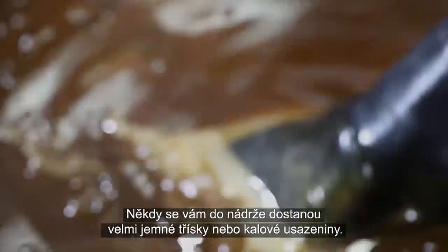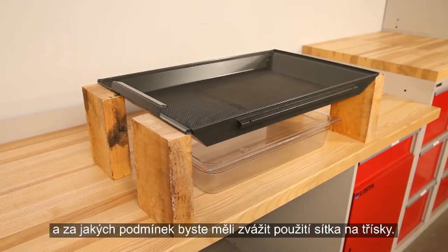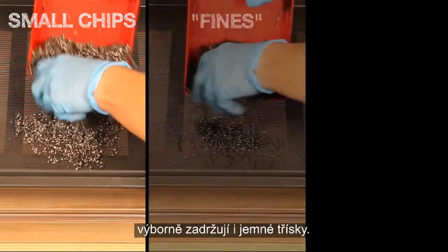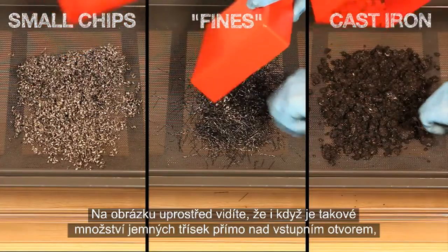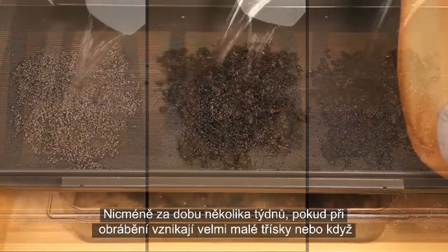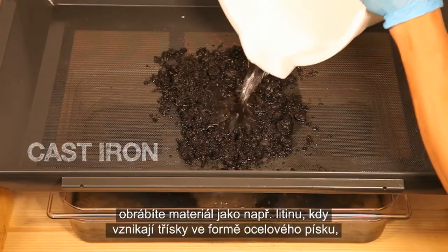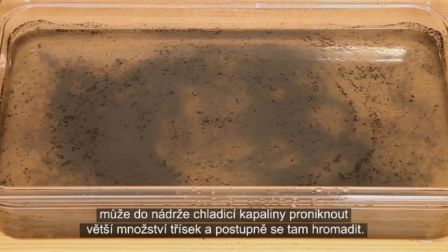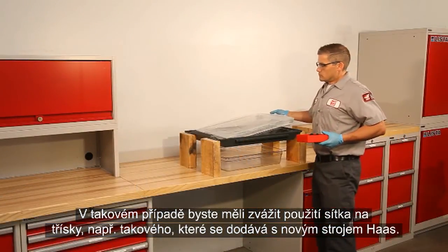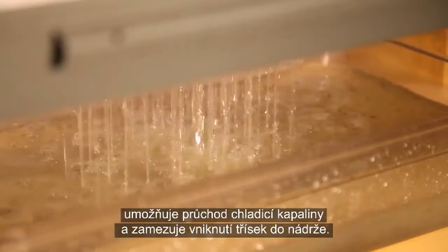Sometimes really fine chips or sediment-like contamination can reach your tank. Let's take a closer look at how the coolant inlet panel works and when you need to consider using a chip strainer. The perforations on the coolant inlet panel are very small and do an excellent job of retaining even fine chips. Even with a pile of fines sitting directly over the inlet area with coolant passing over them, only a small fraction of the chips make it into the pan. Despite this, over the span of many weeks, if the chips on your machine are extremely small or you are machining something like cast iron where the chips form a grit-like substance, a larger quantity of chips can gradually build up. In this case, you should consider using a chip strainer like the ones that come with your new Haas machine — stretched over the supplied chip basket and placed above the inlet panel, it allows coolant to pass through while keeping chips from entering the tank.